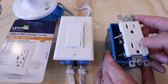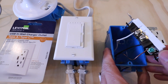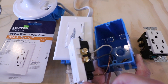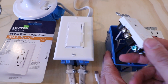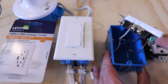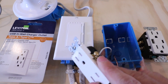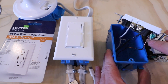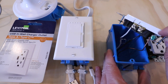Now that we have the two screws removed, go ahead and pull the outlet out so that you can work on it more easily. It's always a good idea to take a picture of the existing wiring. A typical outlet will be wired with a neutral wire on one side and a hot wire on the other. Sometimes you'll have additional neutral or hot wires connected because they're connecting other outlets in the circuit. The last wire on the green terminal is the ground wire. White is neutral, black is hot, and the unshielded wire on the green terminal is ground — sometimes this will be an insulated green wire as well. Now we're going to loosen up these terminals and remove the existing wires.